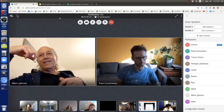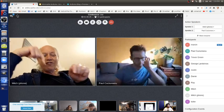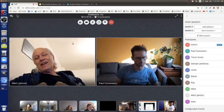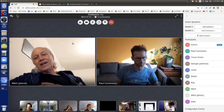Let's say I have a program for a music synthesizer with 12 buttons, and depending on which button is pushed, I get a different frequency. But when I actually try to use it, it's not making good sounds. It's not going duh, duh, duh, duh, duh, instead it's doing something else. So I can add an extra statement in my firmware to blip an LED, just go on and off, whenever I'm in a particular part of the program, and that can give me clues as to a bug in my firmware.